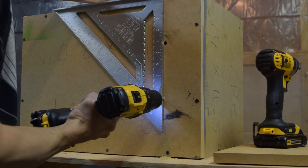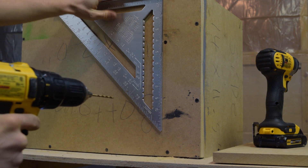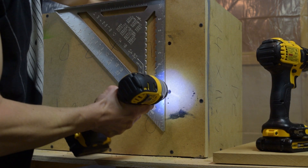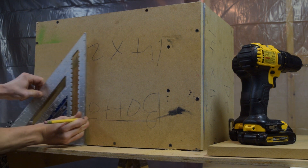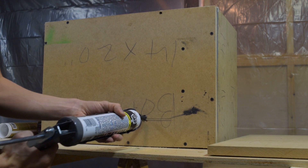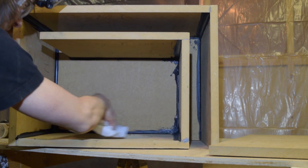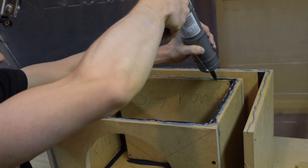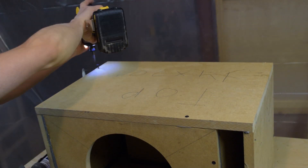I drilled and screwed down the first one, but when drilling the second hole I broke the drill bit off inside the box. No problem — I grabbed another drill bit of the same size and drilled a new hole. I accidentally missed the port slightly on the second try; third time was a charm. Next I'll set the rafter square next to the box, hold the pencil at 2.75 inches and slide it back and forth — the port wall will be right above this line. I'll drill and insert two more screws. If you made any mistakes and have open holes, make sure to fill them with sealant to prevent any air leaks. Then I'll apply sealant to the new edges, and apply a bead of glue all along the middle plus a bead of sealant along the inner edge, since this won't be accessible when the box is closed.